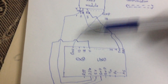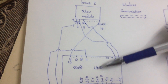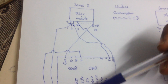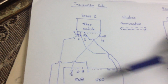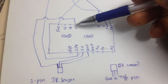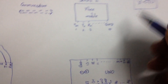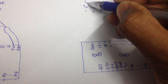To summarize the connections: VIN to 3.3V, TX to RX, RX to TX, and ground to ground — these are the connections between the XBee module and the Arduino. For the IR sensor and Arduino: 5V to 5V, ground to ground, and the output pin connected to pin 11 of the Arduino, as defined in the program.